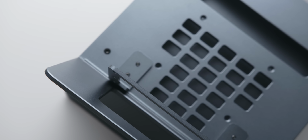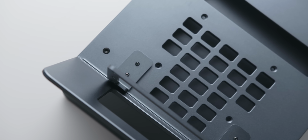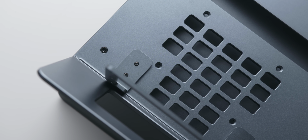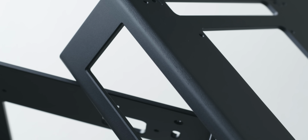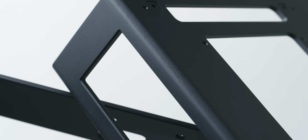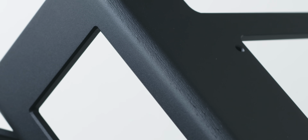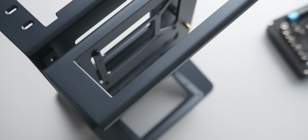Now the CNC machining is excellent, but there is one big drawback of working with and specifically bending these 4mm thick aluminium panels, and that's that you'll inevitably get these stress marks on the outer edge and also relatively harsh creases on the inside. You will notice these imperfections when building on the case, but unless you're really looking for them, they might not bother you.